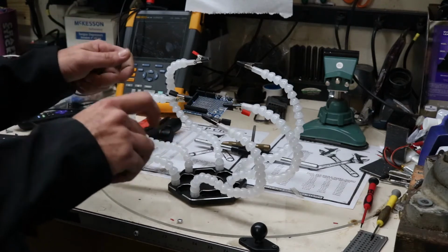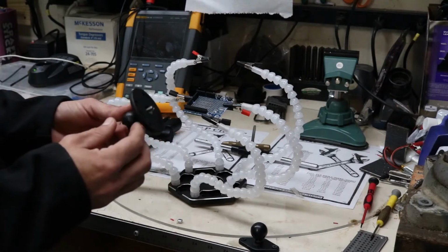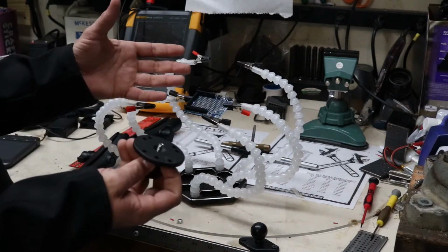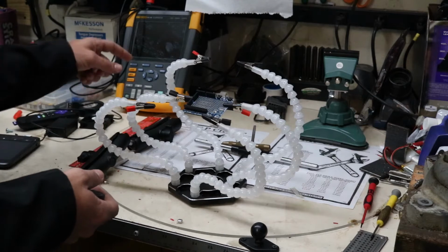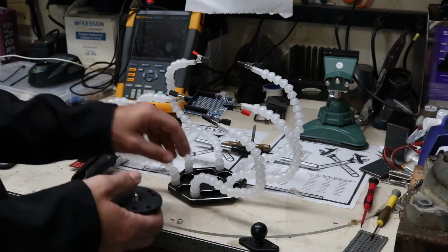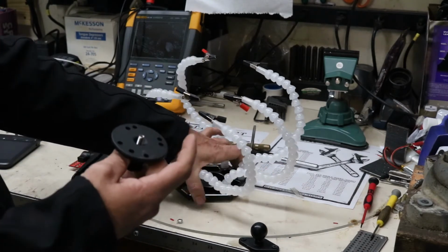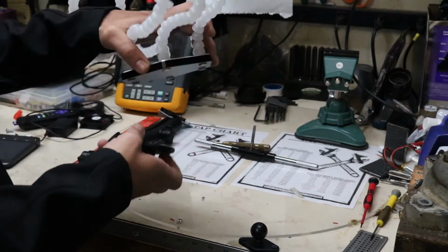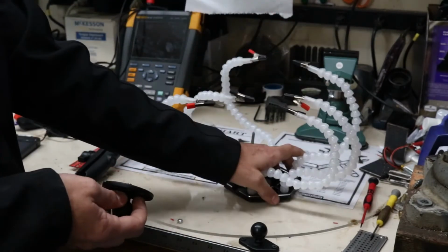The RAM mounts, with the articulating arms, allow me to get it adjusted exactly where I want it, and it holds it very stable. So I'm going to be using this mount so that I can keep my universal system going, where everything I have uses the same mount, and I can use these same 2 or 3 arms and get it positioned where I want it, and I don't have to fumble around for adapters. So I'm going to take this standard camera mount with this 1/4-20 stub on it, and drill a hole in the center of my little helping hands, a 1/4-20 hole, and then tap it so that this will thread in here, and then I can articulate this helping hands wherever I want it for a more comfortable position.